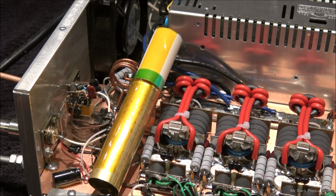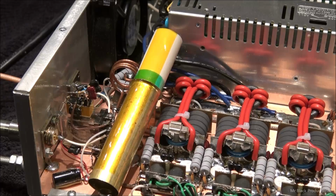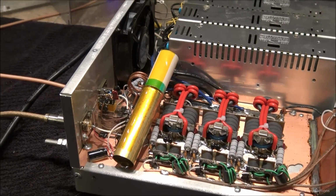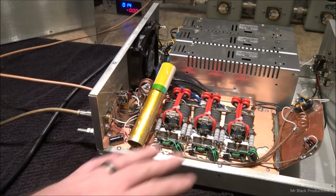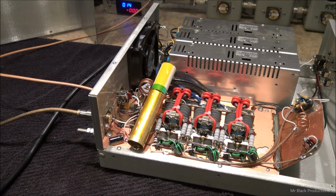And it does have a preamp in it. It's got sideband delay, but no sideband. If you want me to add sideband, whoever wants to buy this, just throw an additional $40 on it. I'll put the resistors in here, put an extra relay in here, and we'll bias it up for sideband, full over Class B. Ready to go.